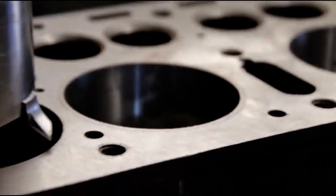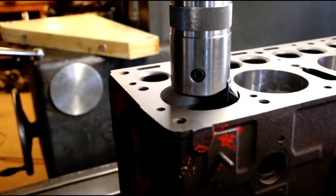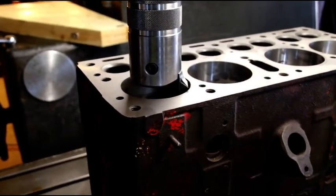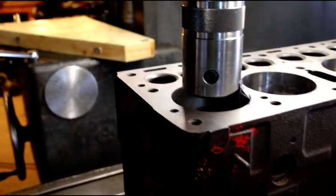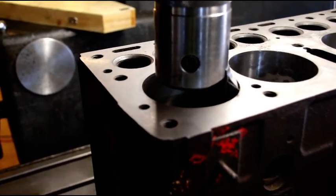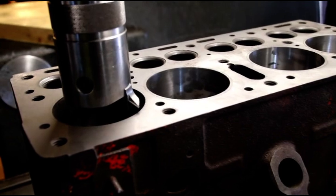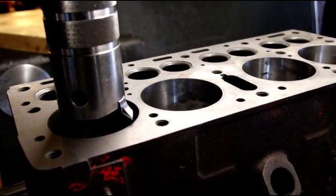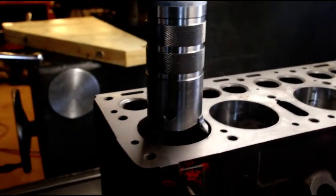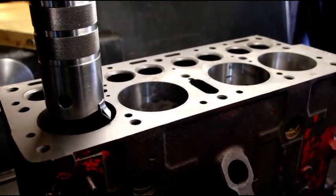I did switch over to my carbide tooling and the finish is much, much better than the high-speed steel factory tooling I had in there. I'm super happy with this - it's the first time I'm using carbide. I used that one tool until it kind of wore out, and cast iron wears tools down really fast, so that's why I went to carbide. The quality of cut is a hundred times better than that original tool. Since I was moving the hole, I started small, went through once, then crept over until I was sure I could get a full cut around the whole thing.